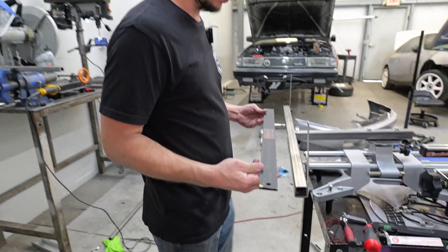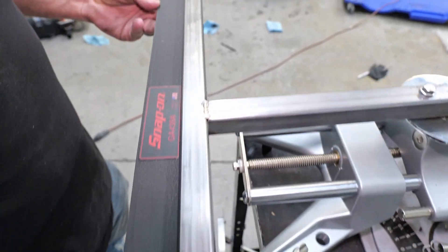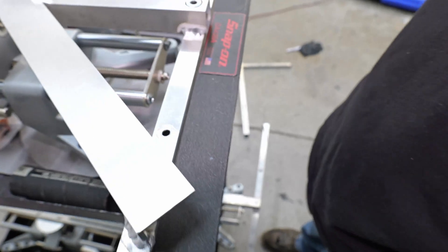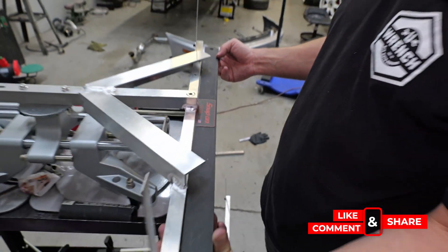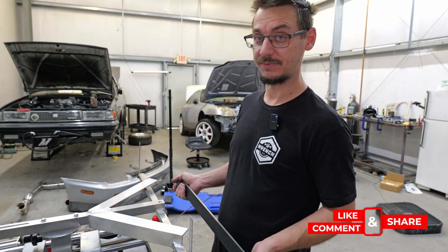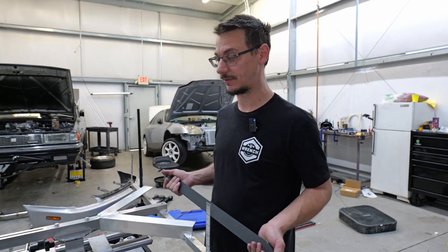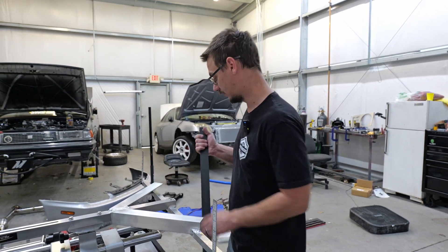So this one, across the bottom here, we have the straight edge and it is just straight. Come over here and match this side up — and that's what we've got over there. You shouldn't be able to see my finger on the other side if we're going for straight. That's what we were trying to fix, because that's going to affect the alignment no matter what. My best guess is it's because I welded aluminum — it flexes. With steel, I can weld at a low enough temperature that it doesn't affect the straightness of the edge, which is what we need.